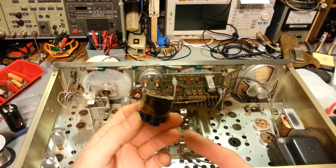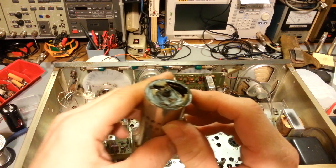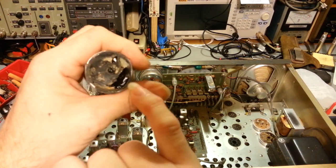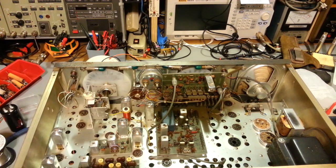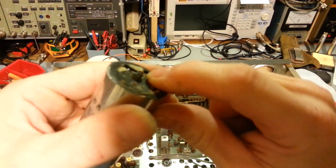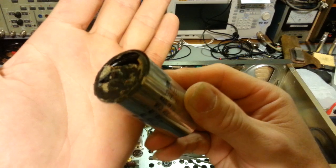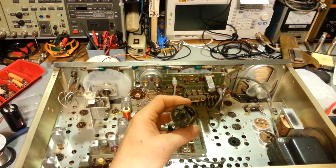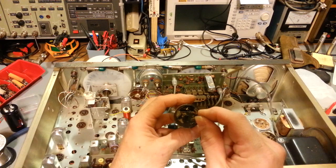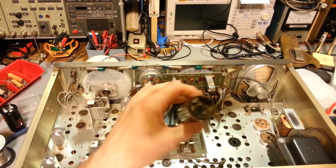It just poured out of this cap — like it was filled with sand. Looking at the leads inside, I can see stubs sticking up but one is way down in there. It's all corroded. That's what happened — the lead broke off. It looks like it corroded down to a tiny thin piece of wire and just corroded in half. So my advice is: if you're going to rebuild can caps, watch what you're putting in the can that comes in contact with the wires.